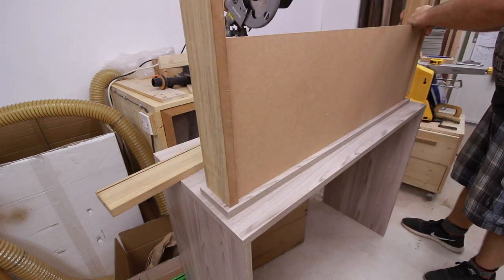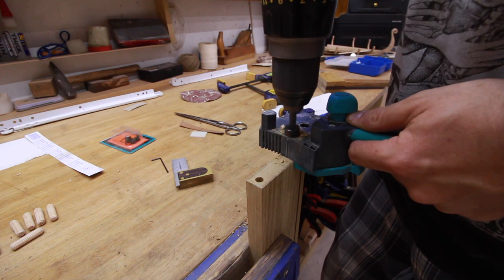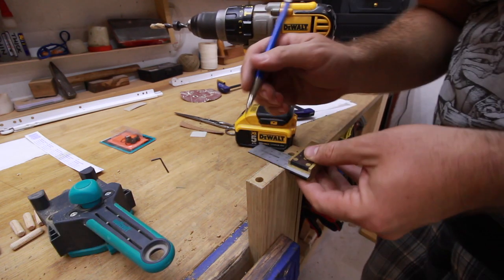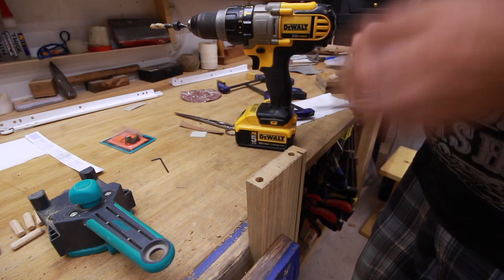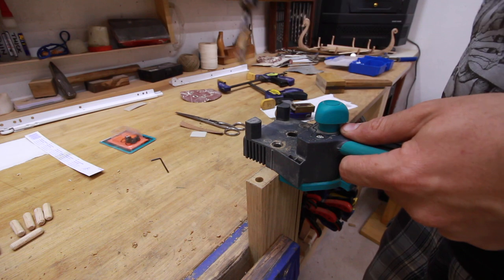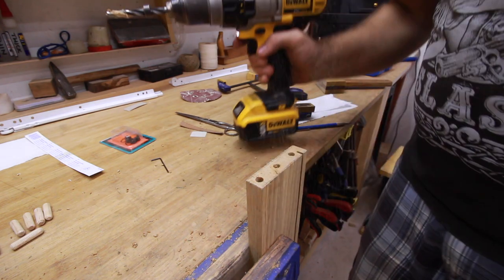To attach the drawer sides to the drawer fronts, I used dowels, but you can use pocket hole joinery as well. I find dowel joinery cleaner, since there are no pocket holes visible and you don't need to patch anything. I also like this doweling jig, it's a very useful tool to have. I'll leave the link down in the description.